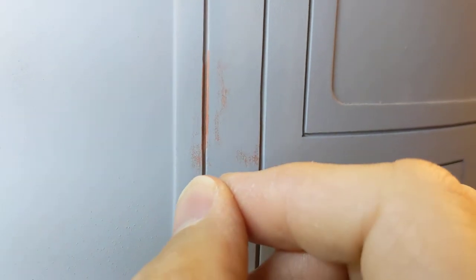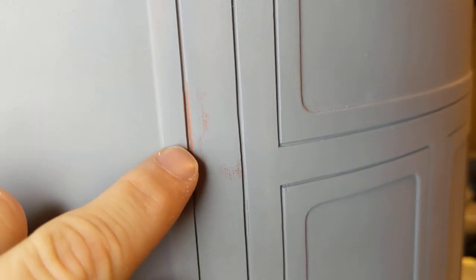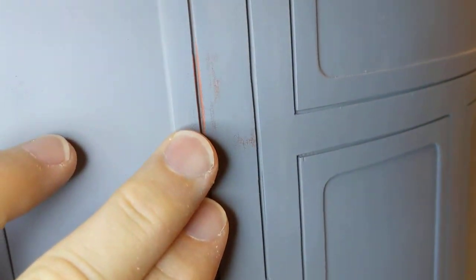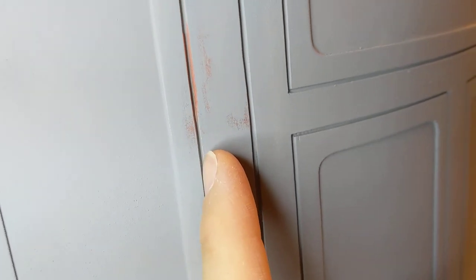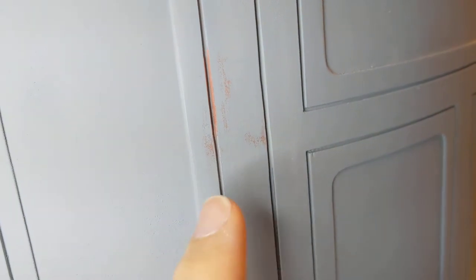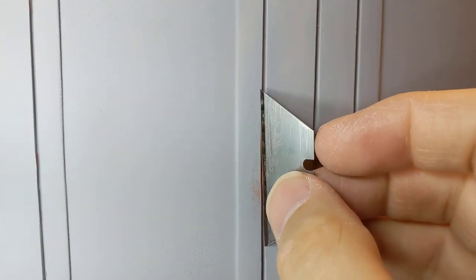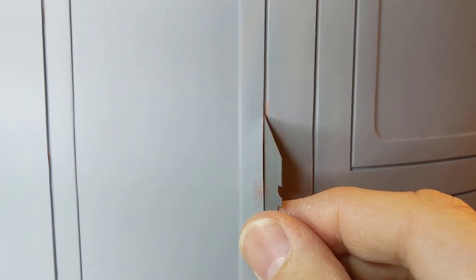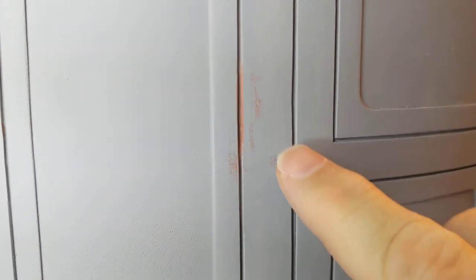I'll take 220-grit sandpaper folded in half and just carefully run it up and down the seam. Because I hold the blade a little bit angled, it gets a little bit more putty in there than needed, and there's also putty on the face from smooshing it in. So once it's dried I'll sand the face smooth, then fold the 220 grit in half and very carefully go up and down just trying to get that area straight where the gap was too wide. I'm basically using the blade as a guide, making sure the top and bottom are where I want that line to be, and then filling in the area that's too wide.